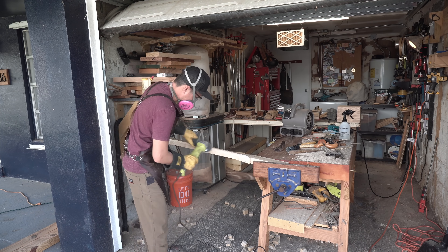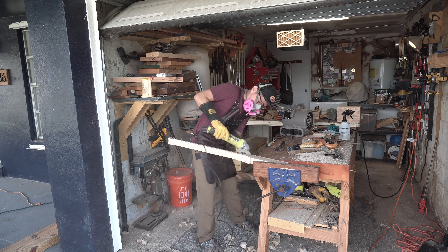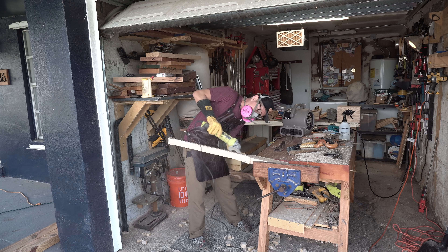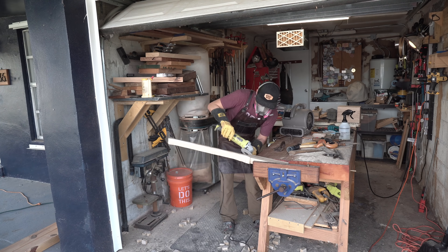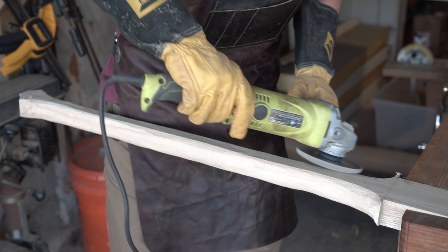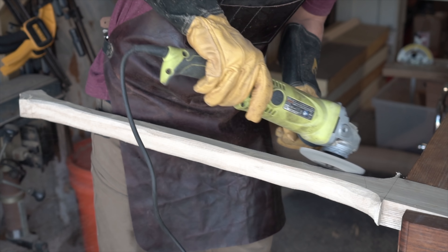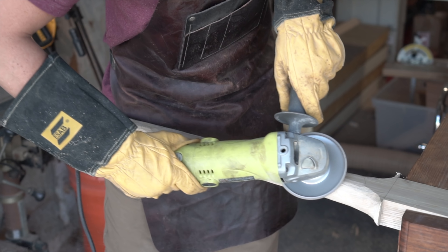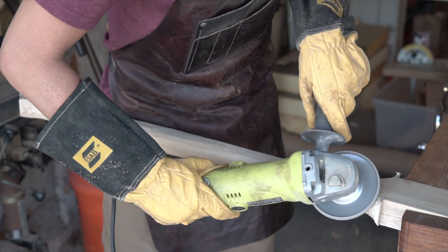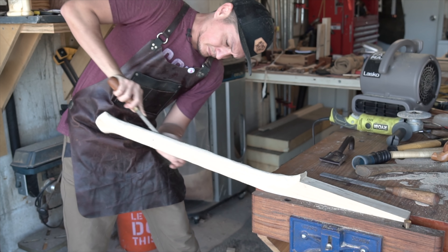One of the reasons I dislike power carving is how dusty it is, so I ended up putting an air mover on my workbench to try and direct the dust in a particular way. Needless to say my wife wasn't thrilled when she went to work the next day and it looked like the sky had snowed sawdust on a car. I don't have a ton of great advice on power carving except to just be soft-handed — I don't even grip the tool all that hard, just try and keep light pressure. If you're really tense you're going to dig in a bit too much and these aggressive discs can bite deep in your work real quick. After I use the disc I take a medium rasp and try to start smoothing things out a little bit better.